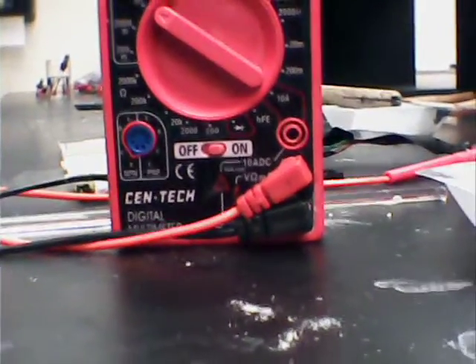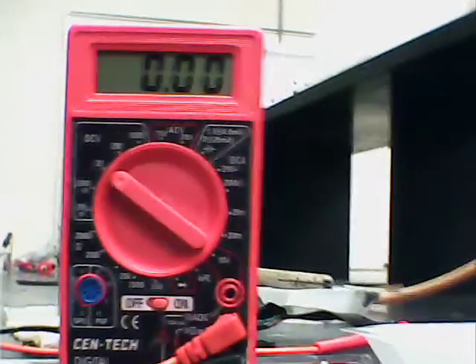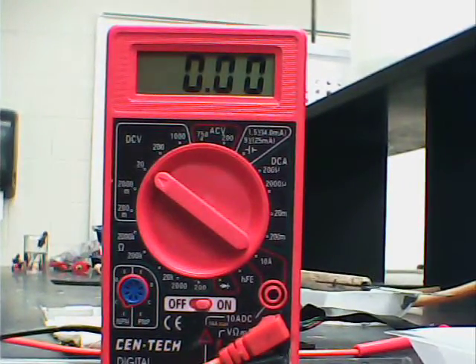Freshly prepared yesterday, I was getting about 1.58 volts. I'm thinking about using nickel oxy-hydroxide — Murray Smith has a YouTube video showing how to prepare it from bleach and nickel chloride with sodium hydroxide. They know that with zinc alkaline batteries, a percentage of nickel oxy-hydroxide will boost the voltage by as much as 15%. So I'm going to be trying some nickel oxy-hydroxide in my cathode material as well.